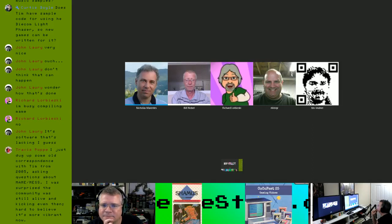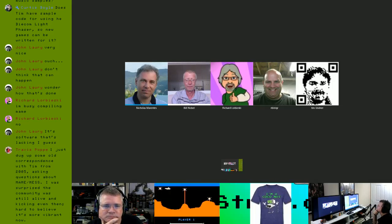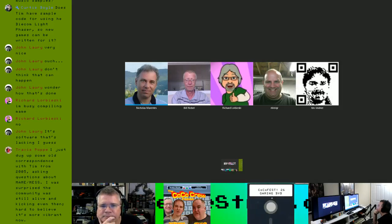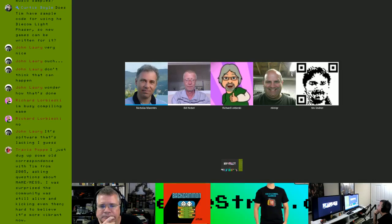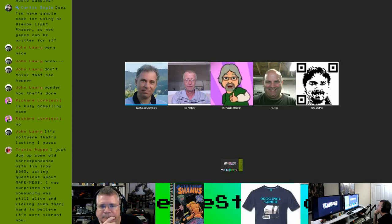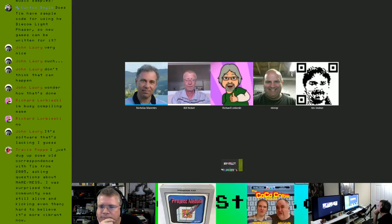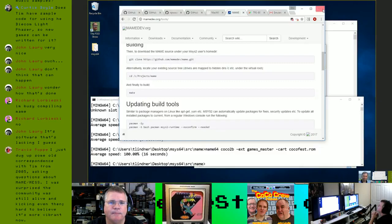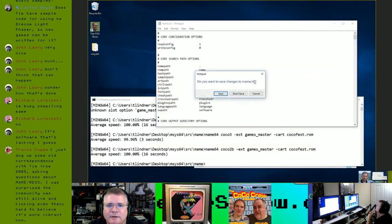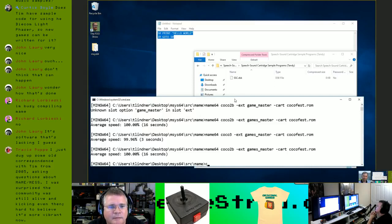Well, you can. I've been looking at a lot of the music that other people have created on ZX Spectrums and Amstrads, and the way they extend the abilities of the chip is to not use the built-in functions, things like the ADSR envelope controls, because they are a bit limited. So they bypass that and send data directly to the sound chip, and can therefore do samples and whatever. But it's more CPU intensive, just like sending data to a DAC. Right. Sorry, I cut you off. Go ahead. Yeah, so it's essentially a 4-bit DAC, or it can be used as a 4-bit DAC.